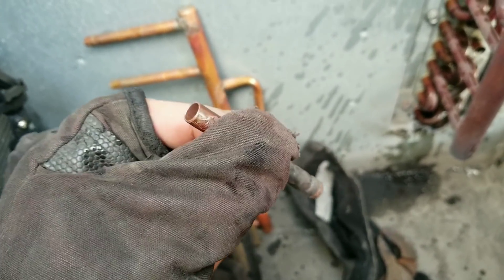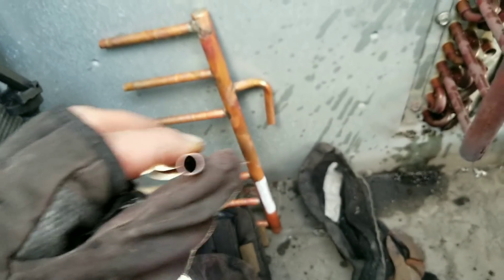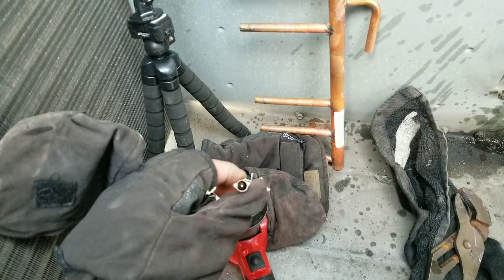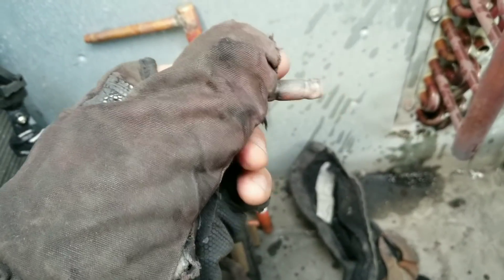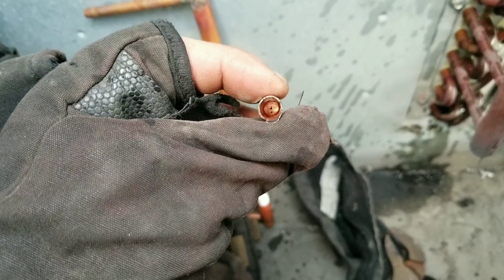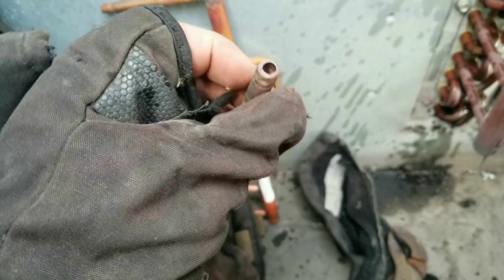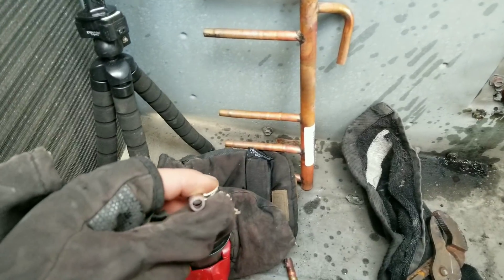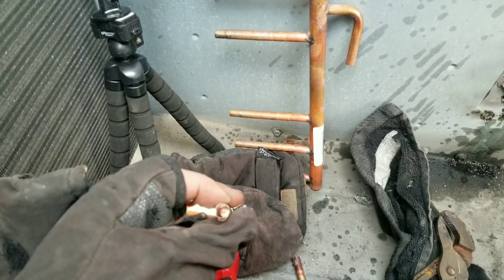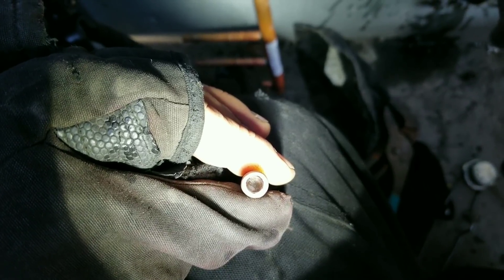This is one of the pistons out of the old piston header assembly. You can kind of see that piston right down in there. This one is the one that broke off and all the oil leaked out — the one I assumed was plugged up because of the oil problem. If we look down inside, it looks plugged up. Yeah, there's no light shining through that whatsoever. So out of six, we had one plugged up. Looking down inside that stubby piece of copper at the piston, it doesn't look plugged — it looks like it was actually never machined properly. There's not a hole there whatsoever.